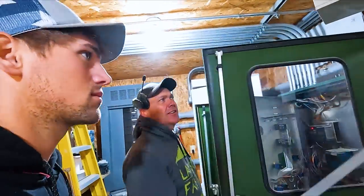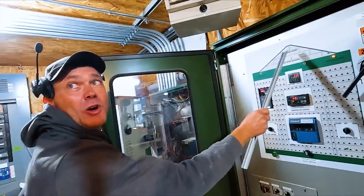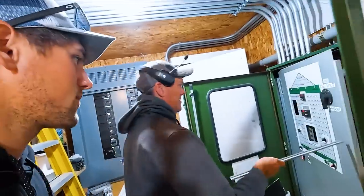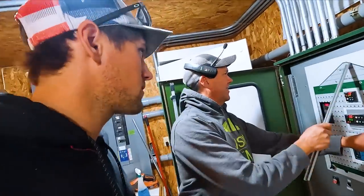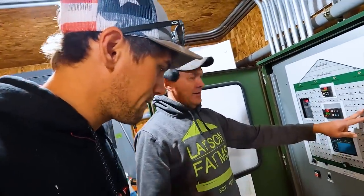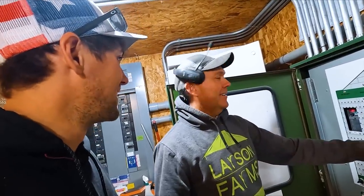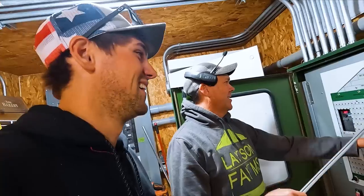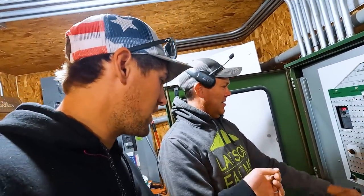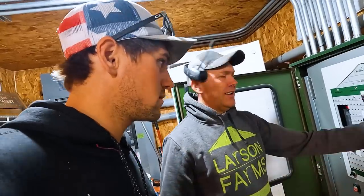As you see here, wet grain load light. When the dryer needs corn, that lights up. This dryer here is only half full and it has never lit up, but it's filling because it's empty and the spout is not full. So I can't explain it if you don't understand it, but why won't it call? I've tried it in run. Get your little leg on. Yes. And this, I believe, has been disconnected, right?